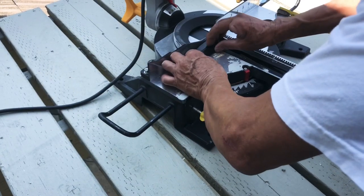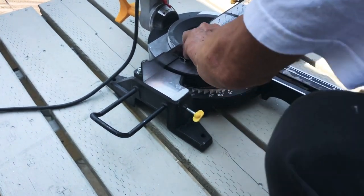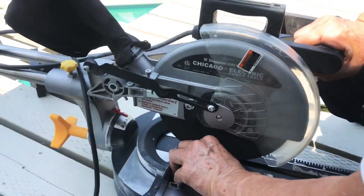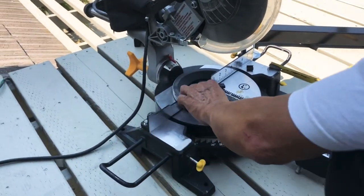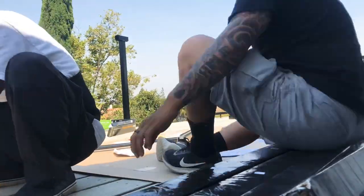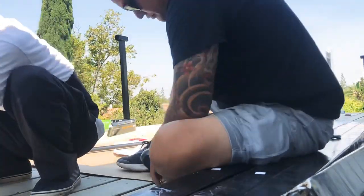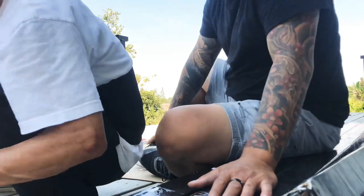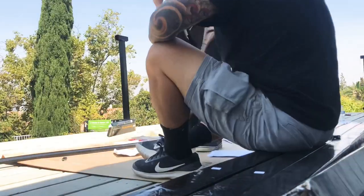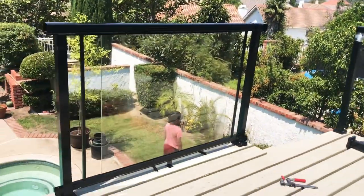We finally found out what we're supposed to do and now we're cutting our spacers because these spacers are what we need. With a railing system you gotta make sure the gap can't be bigger than four inches on any type of stair railing or anything like that. So we're figuring all this out right now, doing all the cuts, making it happen.